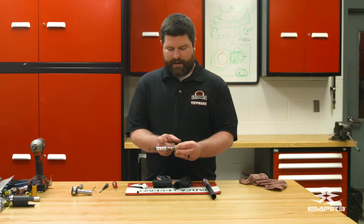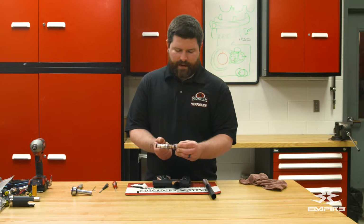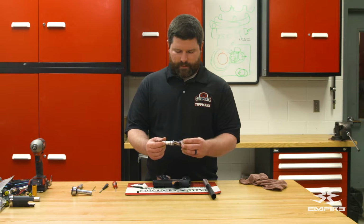And you're not getting equal pressure on both sides, okay? When that O-ring fails, you get about the same amount of pressure on both sides, and then when the solenoid activates, it doesn't really want to shove that poppet out of the way because it's the same pressure on both sides, all right? So keep that in mind.